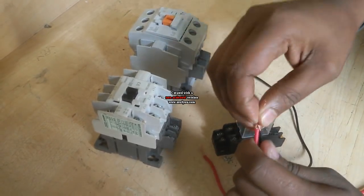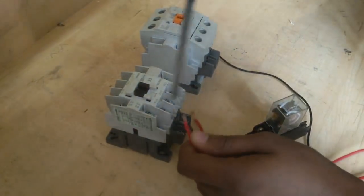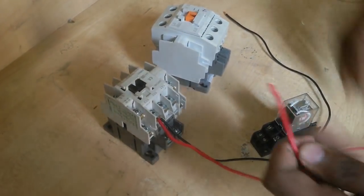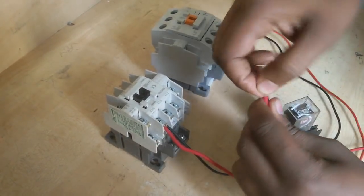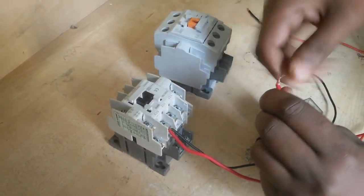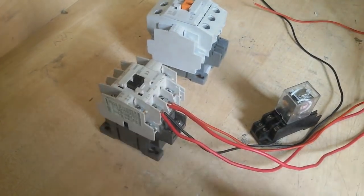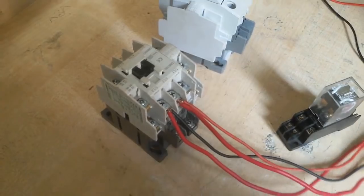At first I add a wire with the supply terminal and connect the magnetic contactor. I add a new wire with the PDB phase wire and it connects the magnetic contactor other terminal, NO side. Here is the numbering 3L2, 5L3.